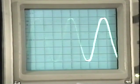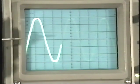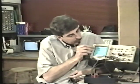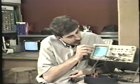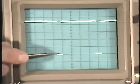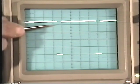Here's another sine wave. In this case, I'm on 2 volts per division, and again, counting up, I see 2, 4, 6, 8, 10, not quite 12, 11.5 volts or so AC. Here's those pulses we saw earlier, and if we take a quick look at the baseline, we can see it's right there, and count up, I'm on 1 volt per division, 1, 2, 3, 4, about 4.5 volts, which is a really good, solid, what we call a TTL level.